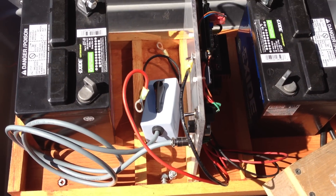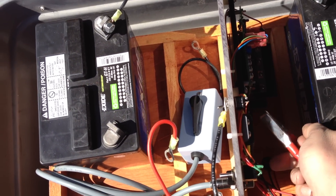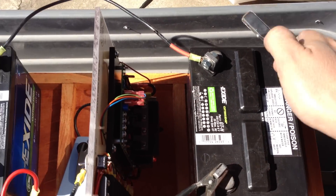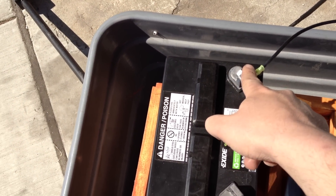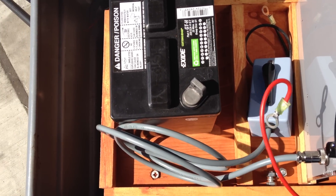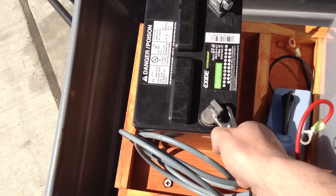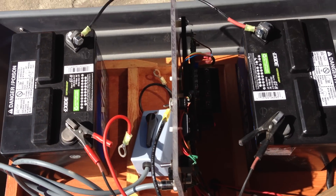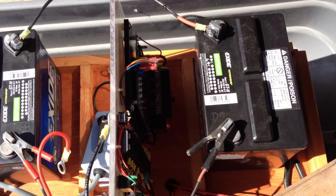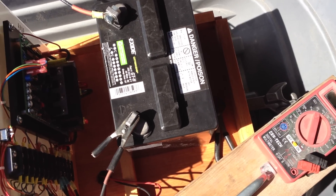So just like charging a 12 volt battery, you would take the negative lead, connect it to the negative end of the battery pack. Remember, we're going from positive on that battery to negative on this battery, thus making this battery's positive the positive for the pack. A pack of batteries consists of multiple batteries connected in a series or in parallel. Now that they're connected up, you can turn on your voltage meter — I broke my own rules; usually you'd select the correct voltage reading before connecting them up to the batteries.